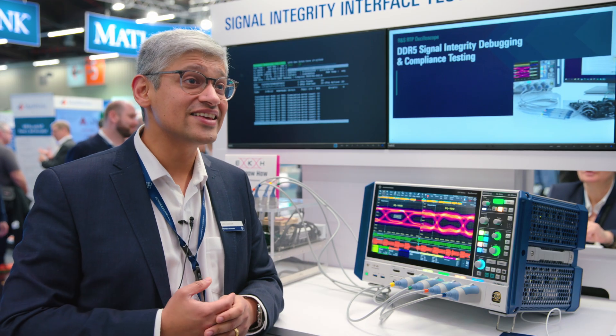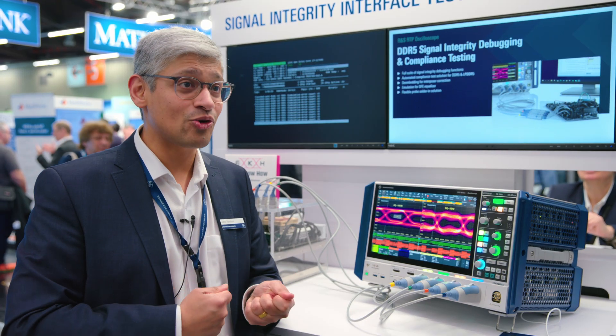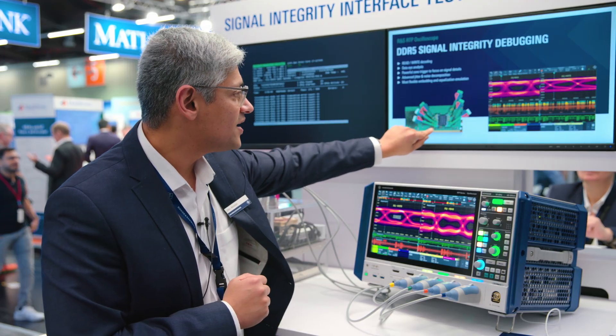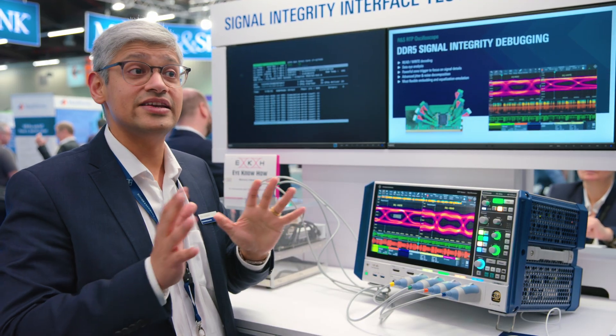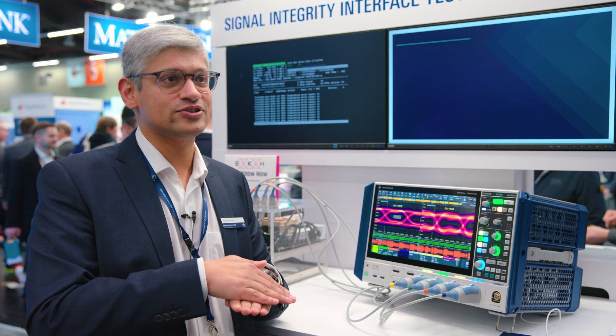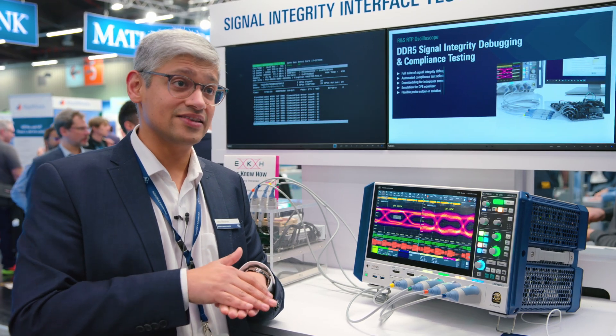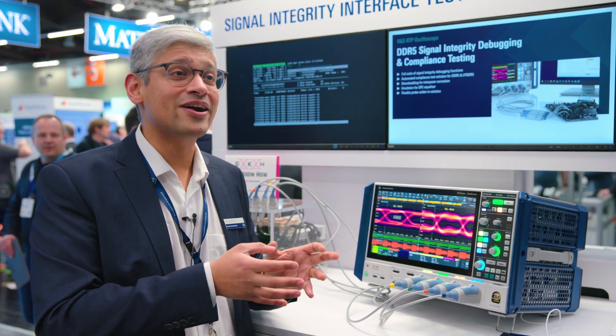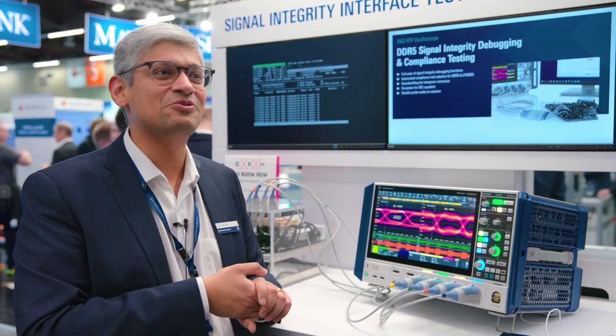When you come down to really fast links, it's about how you reliably probe them without affecting the signal, and whether you can trust what you're actually seeing on the screen. For DDR especially, we have solder-in probes — you can lift the chip up and get access to all the lines, because DDR has a lot of different signals. Having connections as close as possible and minimizing all those effects has a huge impact at higher frequencies. At lower frequencies like 60 megahertz it still has an effect — longer ground loops cause ringing even in passive probes.